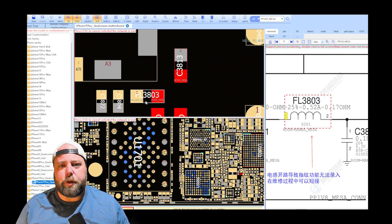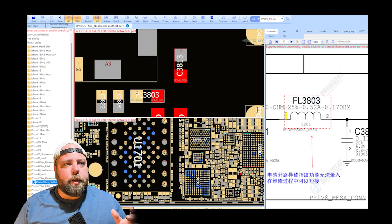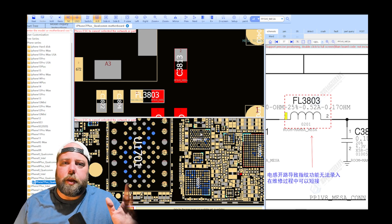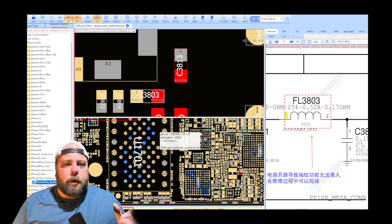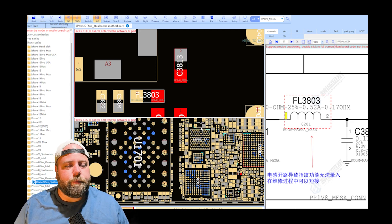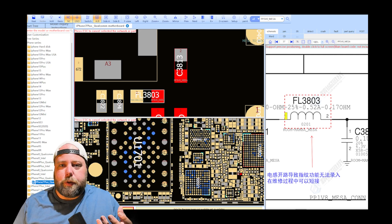Just testing across the filter with the multimeter, you'll know if it's working because it'll either have continuity or it won't. Typically when they're broken, there'll be a physical hole in it, so it's really easy to assess. Looking at this further, it's easy to conclude that the issue is in fact a break between the PMIC and the logic board — either a cold joint or the PMIC itself has gone bad and is no longer able to output three volts to those pins, so we're simply not getting power to the touch ID fingerprint sensor.